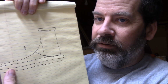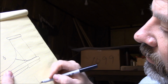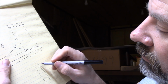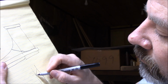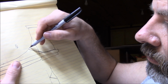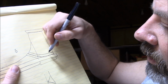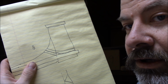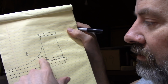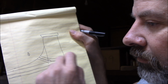And so when you look at a job like this and a repair like this, you want to get, when I say 100%, here's your piece of iron. Okay, better than that. I grind in from both ways or from one way 100%. So if that crack is right here, I've got a bevel that wide. I grind and I grind and I grind. Here I grind all the way back till I can darn near see the grease and get the grease out of the way. The grinding helps burn that crap out of the way, and that's what I do when I say 100%. That's the only way to do it, and do it properly. You gotta get that full of new material.